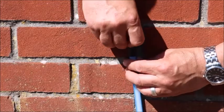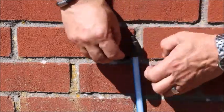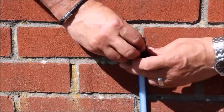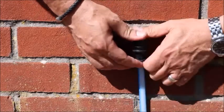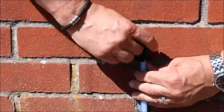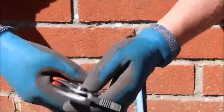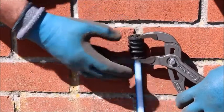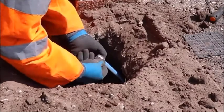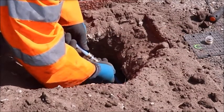Once the tubing reaches the customer's property, you can use this insert to keep the 90-degree bend. You can then apply the Gabacom end cap. Remove the end cap by taking out the green end cap insert and then pushing on a connector to extend the tubing.